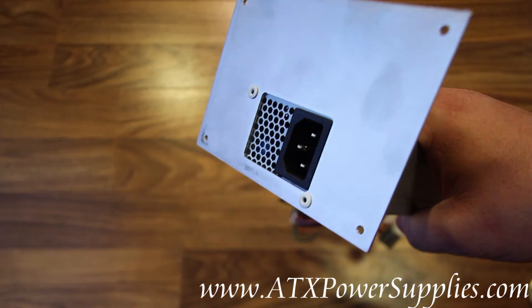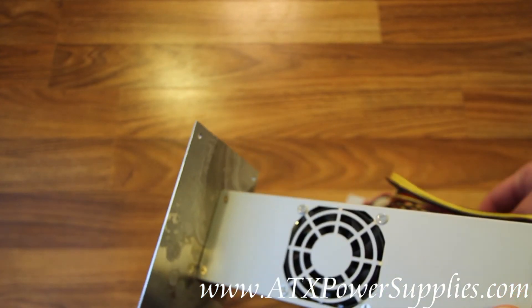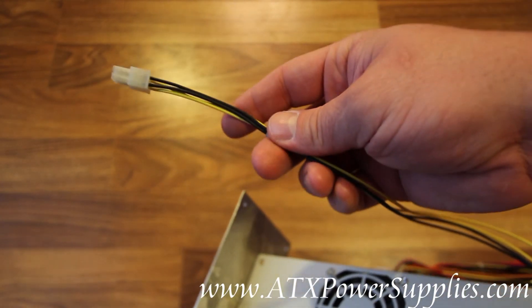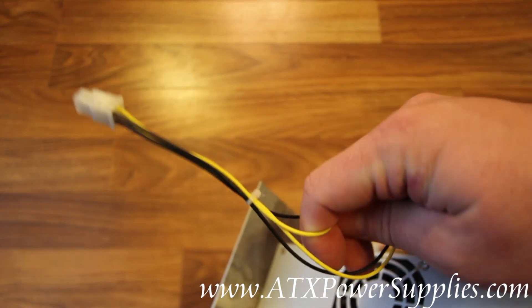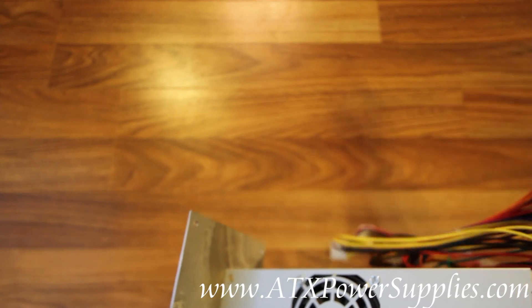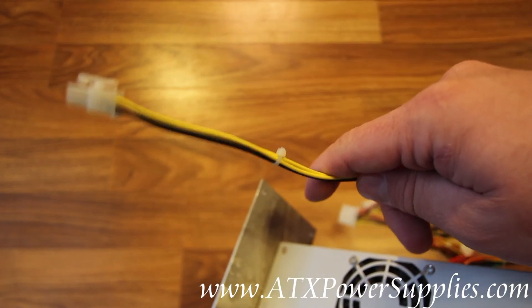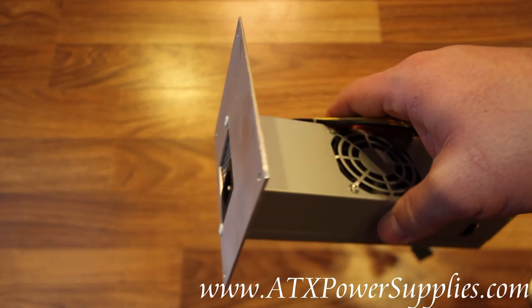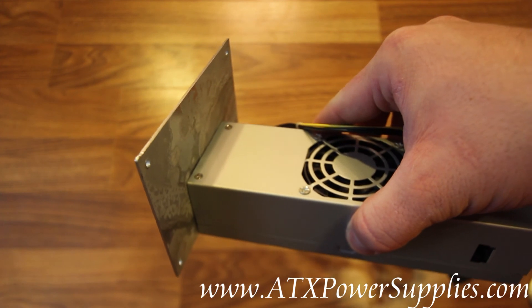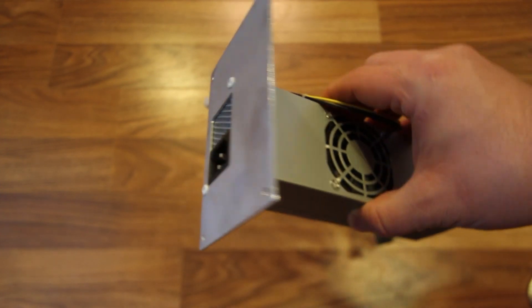That's the exact procedure that you'll use if you need the P8 connector on your new power supply. You'll simply take this P4 wire and tap into it way back here — you don't want to tap real close, otherwise you may not be able to reach your destination. Tap it back here so that way both wires will be a far distance away from each other, and then you should be back up and running again. This is the NPS-200 power supply replacement designed to replace Newton NPS-200-121A and B.